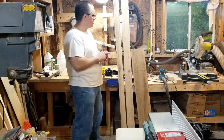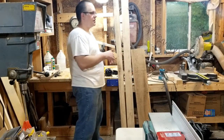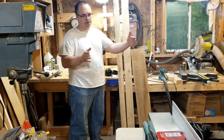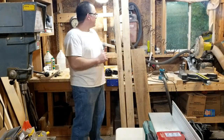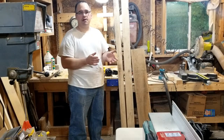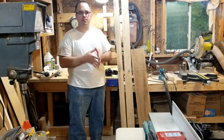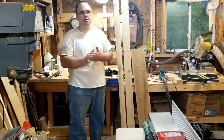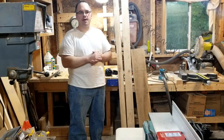So these two boards are going to be 18 by 24. One side gets a juice groove, the other side is just completely flat, and they have a lip on either side so that the board is reversible, and then the board slides right into the countertop. He was quite specific about the fact that he wanted the maple in it that he'd already milled up, which I really like. One of the boards he did ask me to contrast the colors a little bit, so I'm probably going to add in a little bit of walnut, or maybe a combination of a little bit of walnut and cherry to get a redness factor in there too.